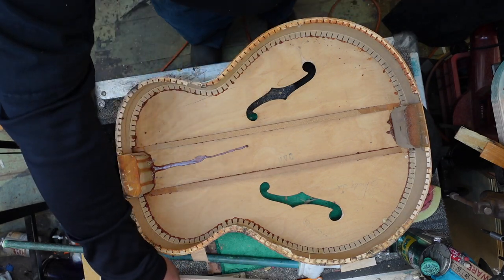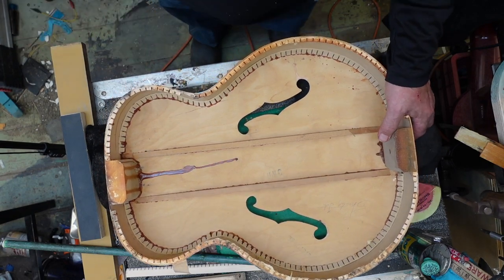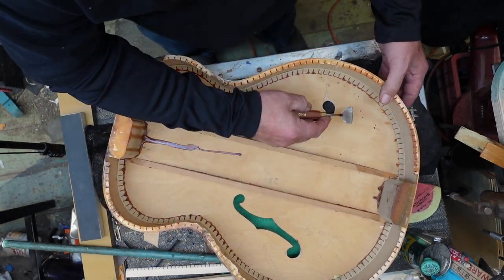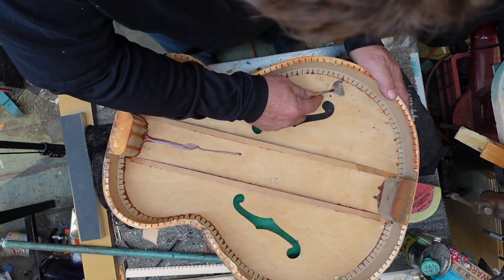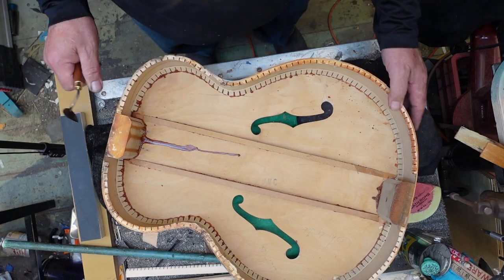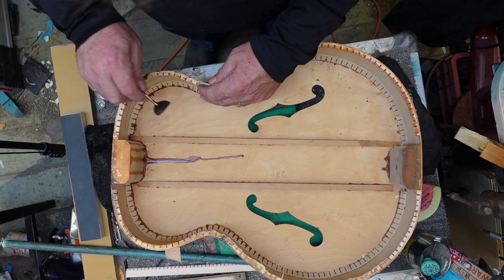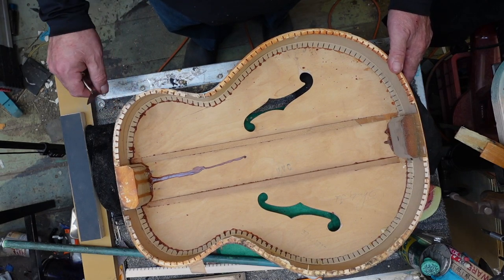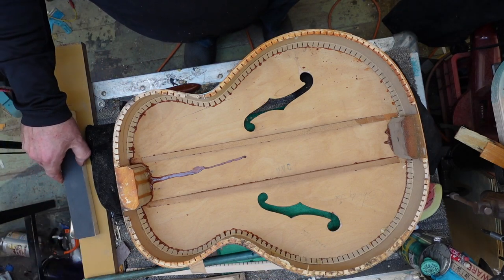That's going to involve cutting this very carefully. And you're getting into the sides now. The sides of these guitars are very, very, well, let's just say flimsy. You can see this stuff is very brittle after all these years, especially the way it's dried out. Just come along like this, but we work on these sides. We're going to end up having to cut this down and then getting the side flat and putting in a new piece of kerfing here and there. I really don't like building it up. I'd rather cut out anything that's missing.